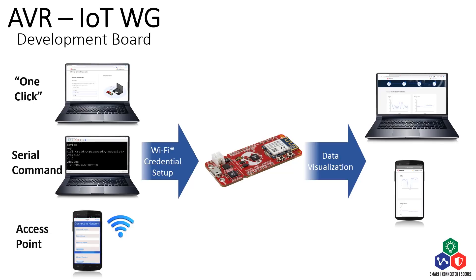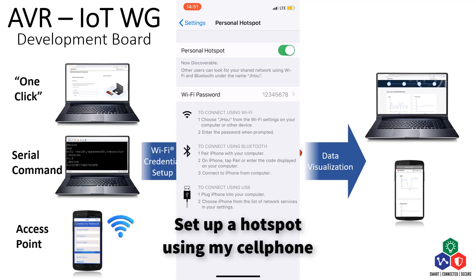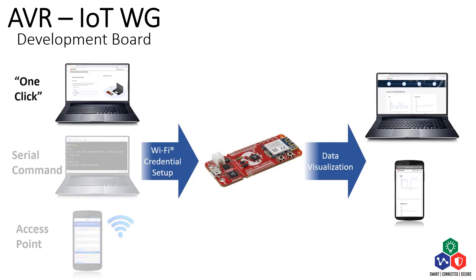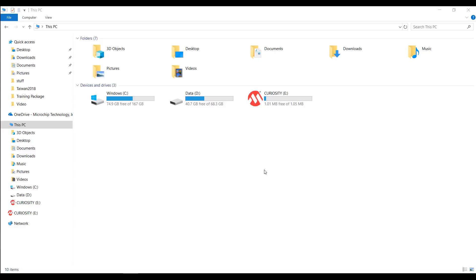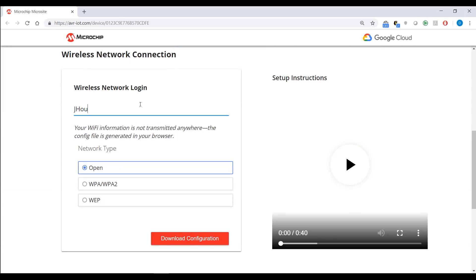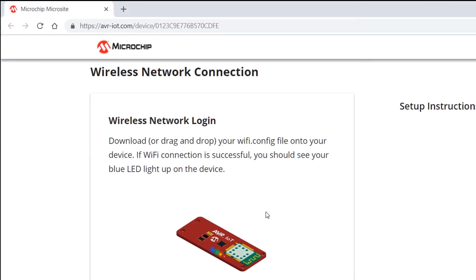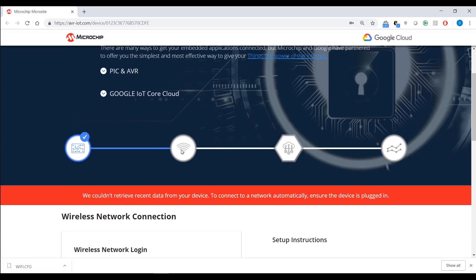Now let's walk through these one by one. In this tutorial, I'm using my personal cell phone to set up a hotspot for Wi-Fi connection because the company's Wi-Fi network has a business server. Please note that a similar situation may also occur when you are trying to use your company's Wi-Fi with the board. The simplest way to set up the board is what we call the one-click or drag-and-drop operation. After connecting the board to your computer through USB, the board should be recognized as a flash drive. By clicking on the click.me file in the drive, it will bring you to an HTML page to set up the Wi-Fi credential. Simply enter the credential of your Wi-Fi network and click on the Download Configuration button. A configuration file is then generated. Drag or directly download the file to the flash drive — in other words, the board. Then within a few seconds, you should be able to see the light and temperature data in the webpage.